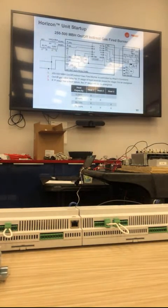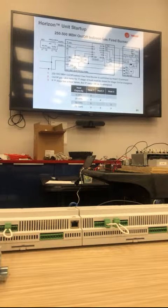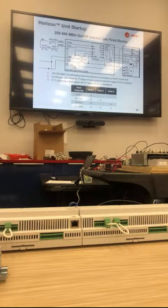And then this is just the heat 3, the on-off, just a full modulate on-off port, so that people understand what's going on. We can sometimes double stack our heaters themselves. Let's say I have an 800 MBH heater. Here's my 400 split manifold. This is modulating. On off. And then we have another burner that is full on off at the bottom. So these are 400 MBH, 400 MBH. Heat 1, heat 2, heat 3.